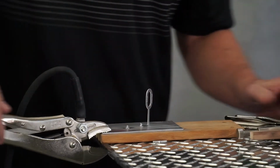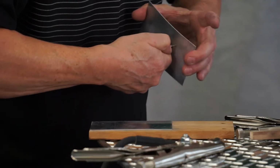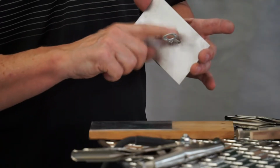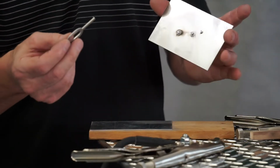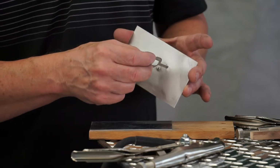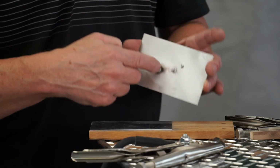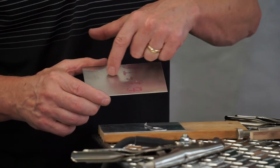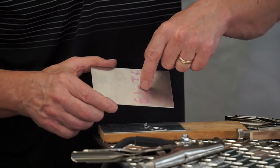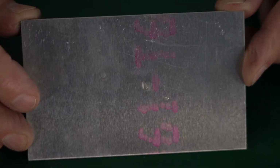So if I take this apart, this is just a very easy test on a simple panel like this. I should be able to take this and be able to pull it, and it has pretty good strength to it. If I take this and do this, it's going to come right off, because remember, aluminum is brittle. When we weld this piece on, this is a very lightweight weld just to pull a dent out, not a stud that we're trying to make permanent into the panel. So we'll get some close-ups of the back part of the panel, the big area of the stud here and the little tiny pinpoint of the tab, which is the difference between reverse polarity and standard polarity in the way that electricity travels through the panel.